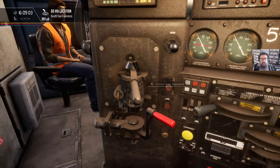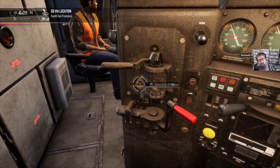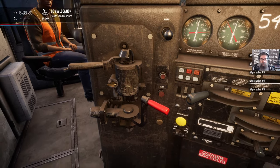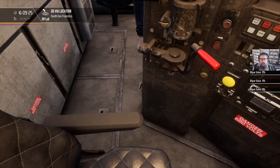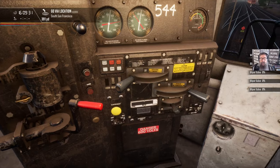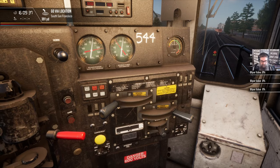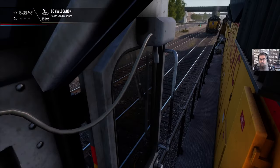We're still only at one locomotive running at this point. We put this into freight and we're going to release our main brakes. We're leaving our independent where it is — fully applied — and we check our MU2A valve: lead or dead, which is correct because we are the lead locomotive. We can leave this the way it is for the moment, because all we want to do now is go down to the other cab and start that one up.